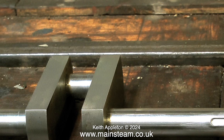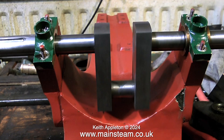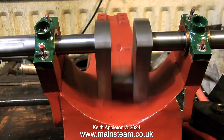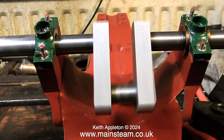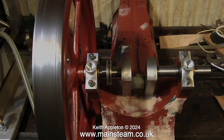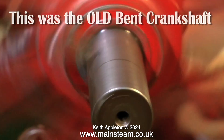Initially I thought about making a new crankshaft, but then I thought most of it is okay. So what I decided to do was keep the shaft at a full three-quarter inch diameter at the flywheel end, which makes for a much stronger crankshaft. This is a built-up crankshaft assembled from different components, so all I had to do was drill out the cross pin and then heat up the crankshaft slightly with the blow lamp — this allowed me to withdraw the bent part of the shaft as the heat destroys the Loctite bond. I then machined a new shaft using my collet chuck, which is very accurate. To keep everything in alignment, the whole thing was re-Loctited together in the lathe. After the Loctite 603 had set, I re-drilled the crankweb and fitted a quarter-inch pin, then machined the keyway in the shaft using my milling machine. The crankshaft is now fully rebuilt and the bearings are fitted — far better than before, as you can see it was very bent and now it spins beautifully.